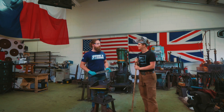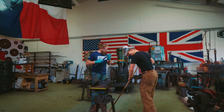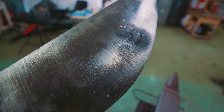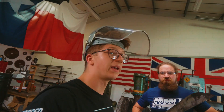Maybe we got it on camera — that would be good. Let's have a look at this crack. To my eye, that definitely looks like a crack. Look at that beauty — that is a wide crack. Anyway, let's temper this anyway because if we're lucky, we might just be able to cut down the blade and make a shorter one. In yesterday's episode, you'll remember we just tempered it with the outside of the forge, which on something so thin is very difficult to get a nice and consistent temper.